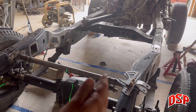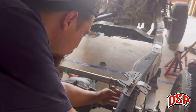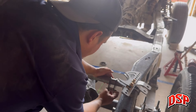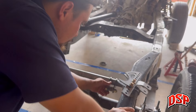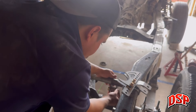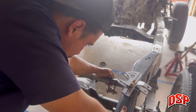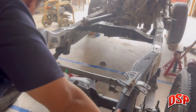I don't want to do anything too crazy — we're going to run into a point where this bolt's going to be real close to the frame, and I don't want that to be more of a pain than it has to be. I'm thinking of doing four inches — put the four-inch mark on the inside, which puts us a few inches from the frame. I can get pretty close there because it's just a nut. I don't plan on changing these shocks every weekend, so it's not a terrible position. Four inches I think is a solid place to get started, and then if I want to change it later I can.